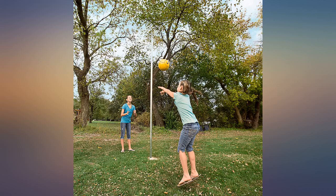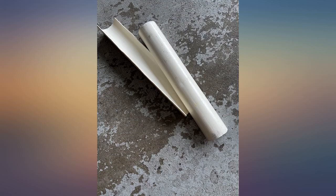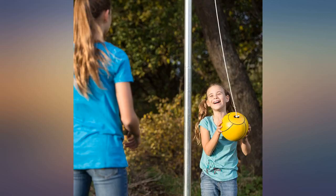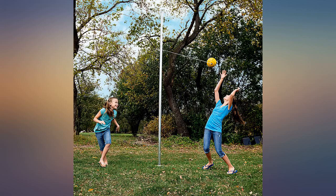Really well made, but the instructions are not suited to climates where the ground will freeze. Placing the sleeve directly into the cement creates a bucket that will fill with water and freeze, cracking the foundation. Place 4 inches of gravel at the bottom of the hole, place the sleeve on the gravel, and then place the cement in the hole — this will allow any moisture to drain.